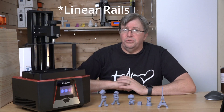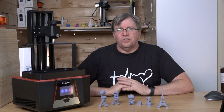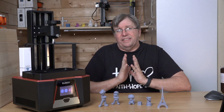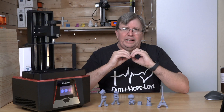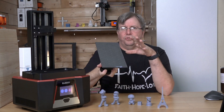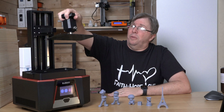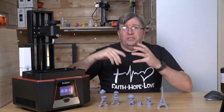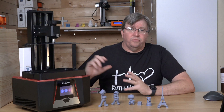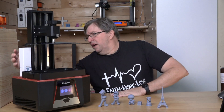It's got two linear screws which makes the drive really neat, consistent, and smooth - giving you those neat, consistent prints. It's got a Fresnel collimating light source at the bottom, an ultraviolet light source that distributes perfectly through a Fresnel lens for that clean, crisp print. It has a laser-engraved pattern on the build plate which seems to work well - I haven't had any prints come loose. The printer comes with a Voxel Dance license for slicing, though I'm currently using ChiTuBox.